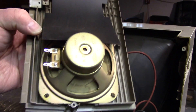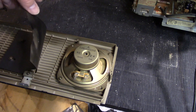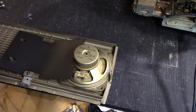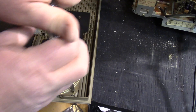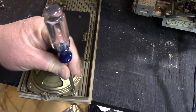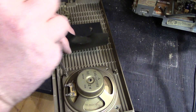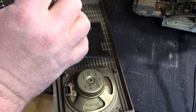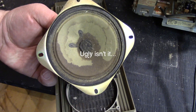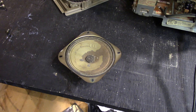This whole panel slides off and there's the speaker — and some other things. It's a little dirty. So let's look at replacing it. You'll notice this little plastic thing here, but you only have two actual screws to worry about. We're going to pull those screws out and set them aside. I'm using a number two Phillips — you could probably use a number one — and there's the speaker. A couple ways you could test it: if you have a tone generator, you can put it on there.